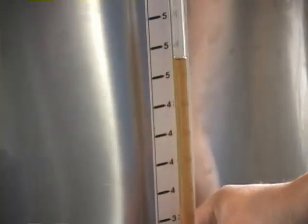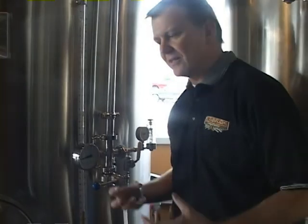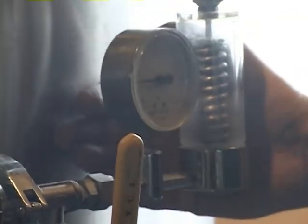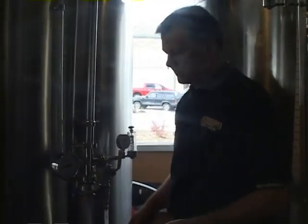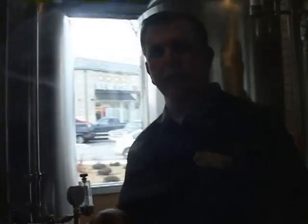Once the beer winds up in this bright tank, the process is nearly complete. To finish, we'll hook up CO2 at the bottom of this vessel. There's a stone inside — similar in some regards to an aquarium stone, but with a lot smaller porosity and very fine bubbles. We're pushing CO2 in at 15 PSI, and a device holds the pressure in the vessel up to 14 PSI, which keeps the bubbles constantly fizzing at the bottom of the tank. Because the liquid is cold — held at 34 degrees Fahrenheit — that carbon dioxide bubbling through the solution will dissolve into the liquid and carbonate the beer.